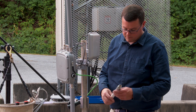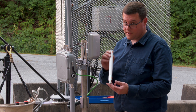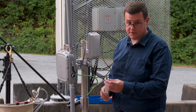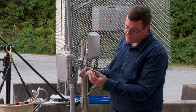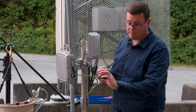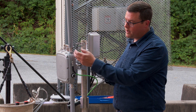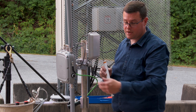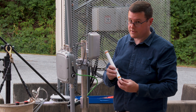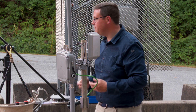One more thing worth mentioning: some older antennas we sold, like the 2547 in white — common with the 1552 — actually had drain holes on the bottom. You would never want to tape up those drain holes, so tape below the connector but not up into that part of the body. More modern versions, like the 2568 and the updated 2547, no longer have these drain holes — a small upgrade over the years.